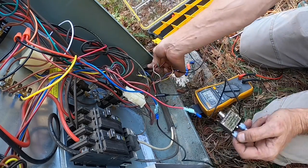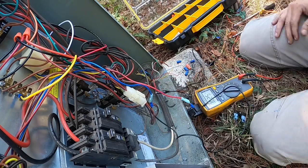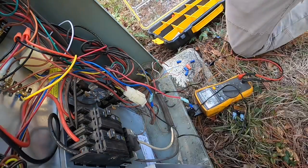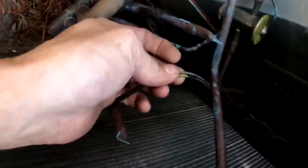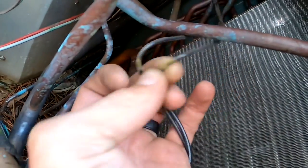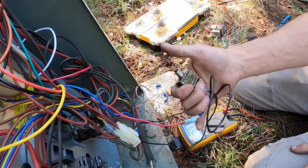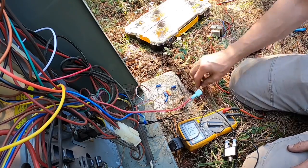I'm fixing to do it again — and it blew. It's time to look at the reversing valve and possibly frayed wires going to it. I just unplugged my reversing valve and I found these frayed wires. That looks like that may have gone to metal. I'm going to tape that up and see if it still trips.